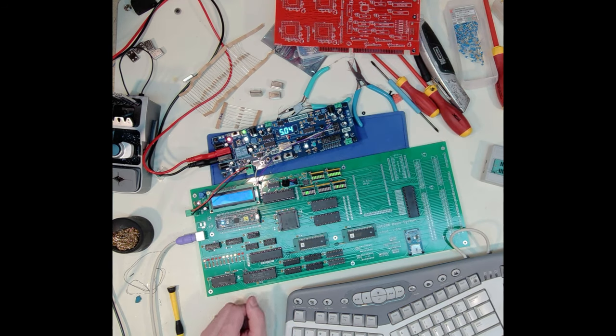8 megahertz PCB is running. And like I said, I think everything's working. So clock generator I know is working. The bus controller is working. The only thing I have not tested is a call to the math coprocessor, which would be really easy. All I have to do is uncomment that in my code to have it actually call that test. Right here, math coprocessor. This is my PIC, my programmable or peripheral priority interrupt controller or programmable interrupt controller, are the two names it goes by, but my math coprocessor right here.